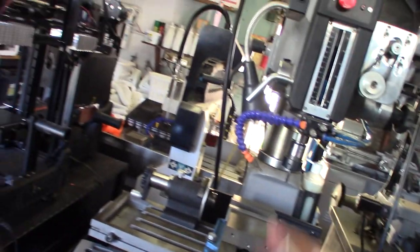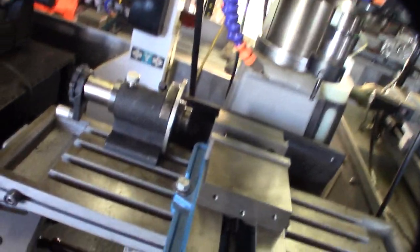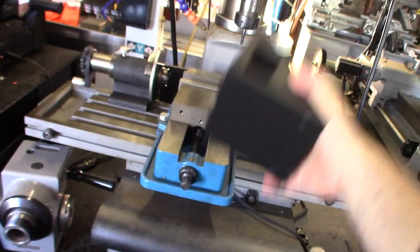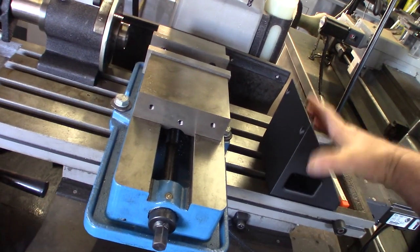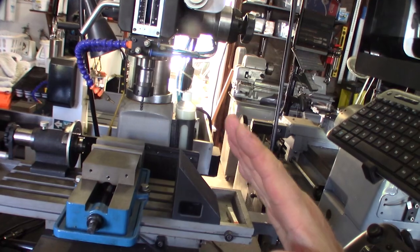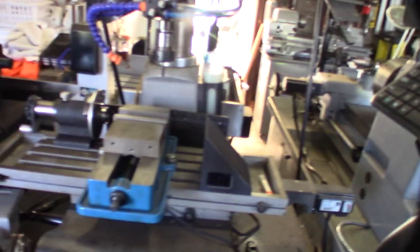I guess I could do it on the CNC router too as well. I mean, that thing can do aluminum. But I actually 3D printed a mount out here. Let me show you. If you're not familiar with this machine, I have a fourth axis indexer. The center rotation, the middle ones, I just do on the indexer, but also on the 45 degree angle, I designed this mount for the indexer so I could put the indexer at a 45 degree angle to create those pockets, and also because I need a flat space to do the drill.